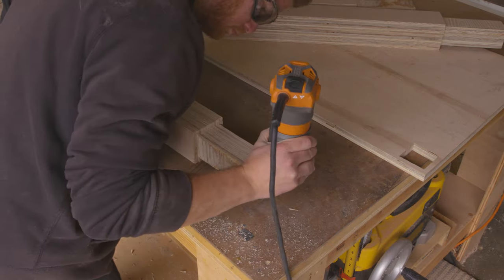I wanted to not use any fasteners on this project, but I couldn't quite figure out the right angles to be able to glue the supports to the ramp. So I used a countersink drill bit to pre-drill through the ramp into the supports, then applied glue to the supports and drove in two and a half inch screws, making sure that they were completely flush and recessed into the ramp. I'm going to be covering the ramp with carpet tile, so I'm not too worried about seeing the exposed screws.